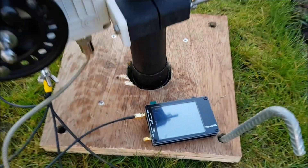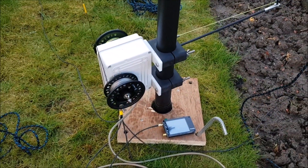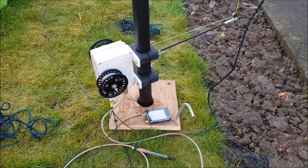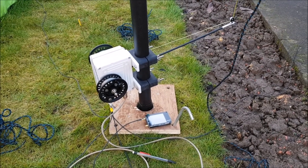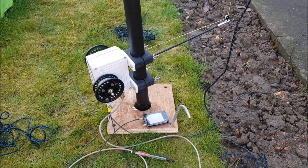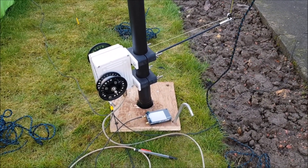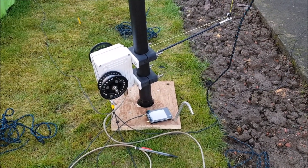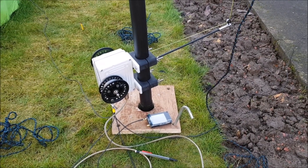I think that's quite incredible for an antenna like this. Obviously we've only got 7 metres height here, linear loaded, but to have an antenna that's only 7 metres high for 40 metres and have the entire 40 metre band less than 1.8 to 1 across the band — I think it's quite incredible.